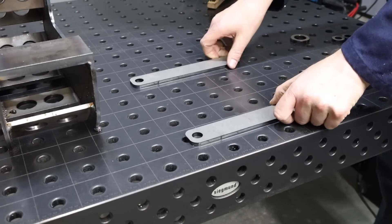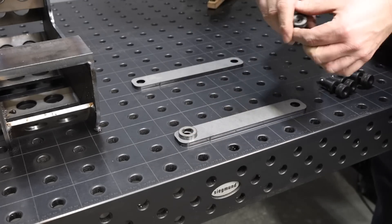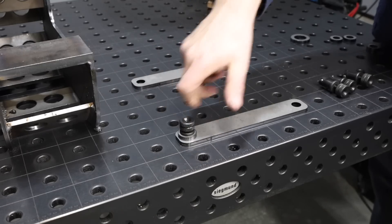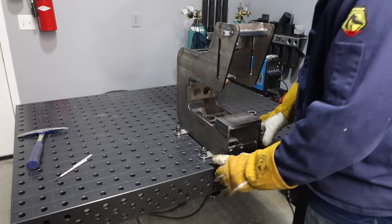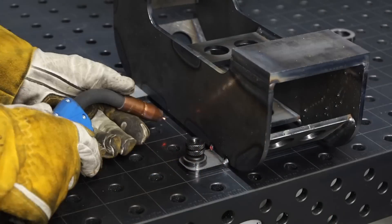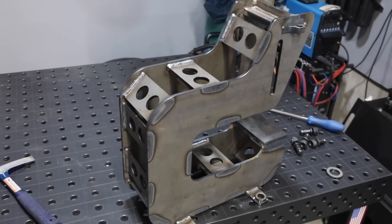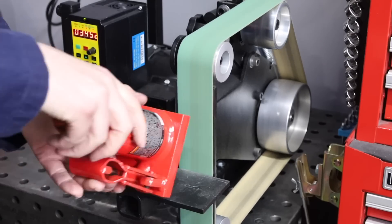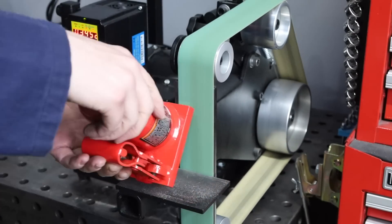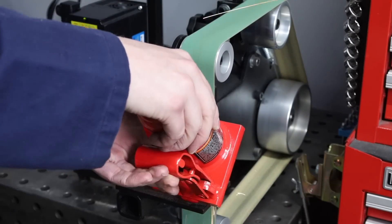With the welding on the frame out of the way, I'm going to set up the base. I want to be able to attach this to my welding table using these bolts, so I had some little spacers and washers cut out to thicken it up so they'll fit just right. I'm going to fasten the whole thing down to the table while I weld it. The last welding to do will be on this carriage, filling out all of those joins. I'm using my 2x48 belt grinder that I built on the channel a few months ago — this has been a game changer in the shop and I use it all the time. It's able to remove a lot of material quickly and give a nice chamfer.